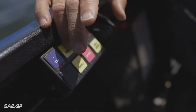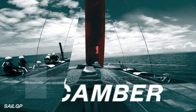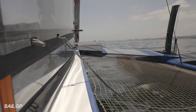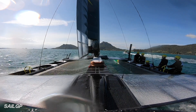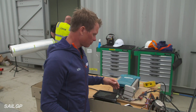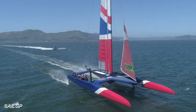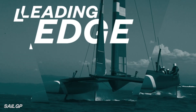The other control is the camber — that's the actual depth in the wing, which is kind of like sail trim on a normal boat. We can play that with hydraulic rams. Camber going into the wing makes the wing deeper, so when we want more power, or the boat's sailing at slower speeds like downwind or in light air, we increase the camber. We can retract it to pull the shape out, so on a really windy day upwind or reaching at high speeds, we're sailing quite low camber angles to reduce the side load and get the leading edge at the correct angle.